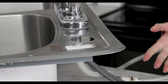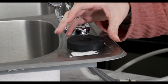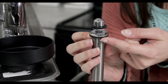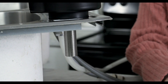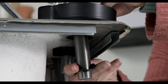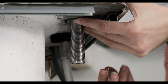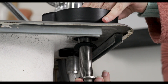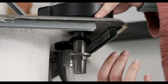Now that we know all about the different parts, I'm going to show you how to get this installed — and it's super simple. Because there's a raised flange on this sink, we are going to install it using the spacer. So let's put the spacer in, set the plate on top of that, and then we'll put the spray assembly in. You'll see that there is a plate gasket and a gasket underneath. Slide that through and then we're going to secure it from the bottom. We have a gasket to slide up, a washer, and then the fixing nut. We'll hold this from the top to keep it secure — if you're under your cabinet you'll probably need another hand to hold it from the top so it's not moving around — and then we'll just spin this up.